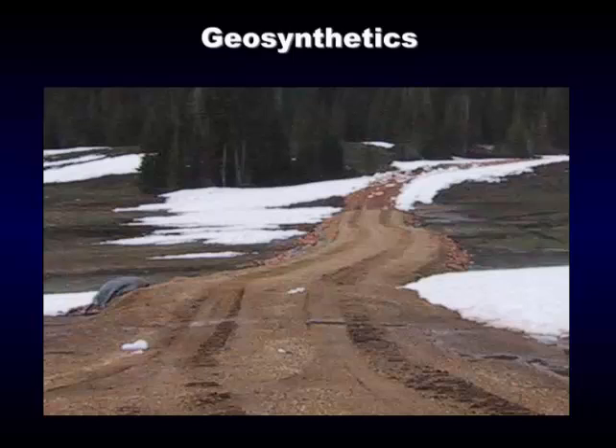What we chose to do is put a French drain on top of the ground. You've probably heard of French drains underneath the ground using big rock, but this one is on top. We came in and used five-inch rock, built it up about two feet high right on top of the ground, then we take what we call geosynthetic — it's a material like visqueen, only it's woven real fine. There are three or four types: some will let water flow through, others will stop it. They look the same so you have to talk to the company about what type you need.